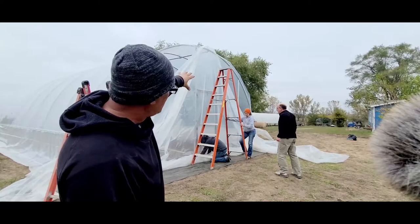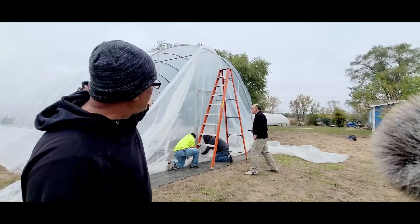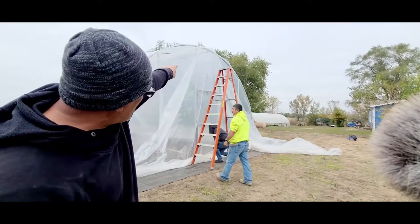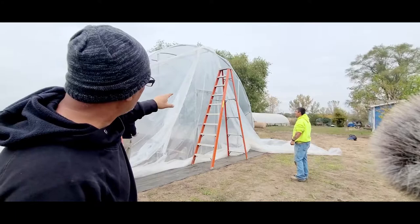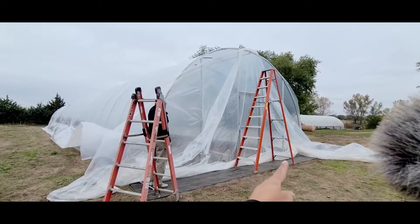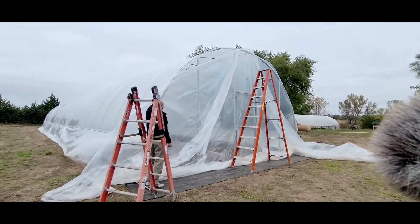We secured the top half of the tunnel with a piece of wiggle wire in the tracking and then cut the plastic. You might ask why not just pull it down without cutting, but it's a square piece of plastic being fitted to a half-circle opening — if you did it that way it would bunch in the middle. So the only way is to cut it, start at the bottom with wiggle wire tracking, use the painted marker line as a guide, and then have one person on a ladder pulling the top, one on the bottom, and one on the side. Set the bottom level and tight first, then pull the slack out from the top like a pie shape, put another piece of wiggle wire in, and it will pull everything nice and tight.